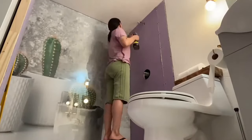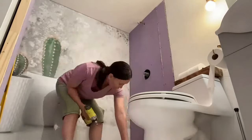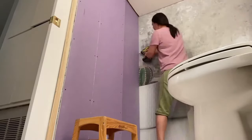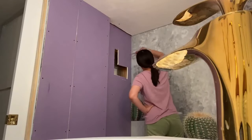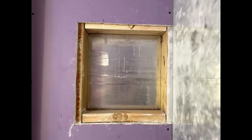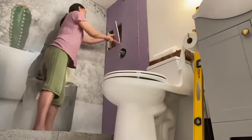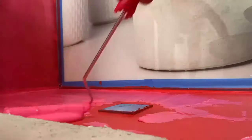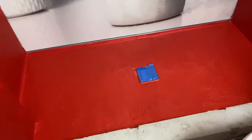After the glass was placed, I installed the drywalls on the side to hold the glass. I was told that it is extremely important that the edges of the tempered glass sit against padding — if you put bare tempered glass edges on concrete, it will break.